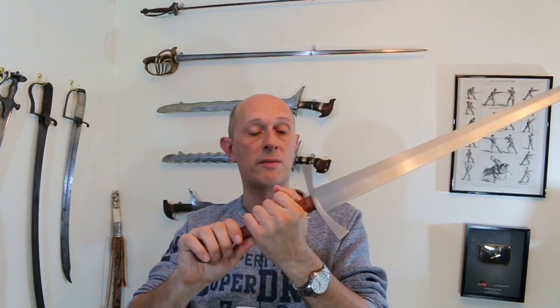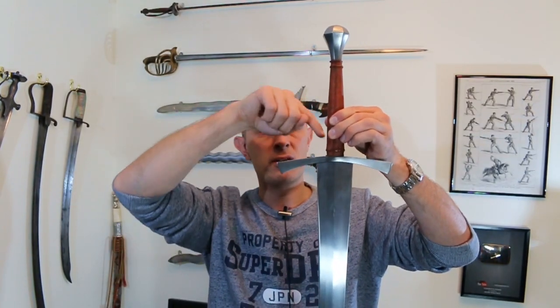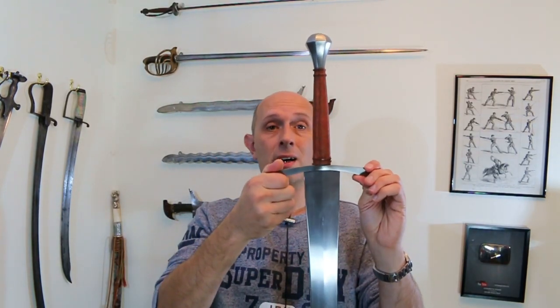There is another way as well. If the guard does come loose, sometimes you actually see hammer marks either side, and you can essentially squish the hole — use a punch or chisel and hammer in there — so you again squish the metal to grip the tang. So essentially, guards on these types of swords are hammered on and hammered on to be solid. They're obviously not welded or pinned through — I know some modern replicas do that, but that's generally not done historically. I won't say it's never done, because it is done with some langmessers and certain types of knife or sword, but generally speaking with cross-hilted medieval swords they are hammered on.